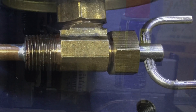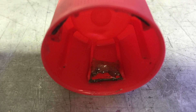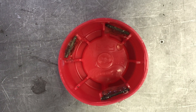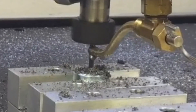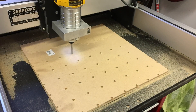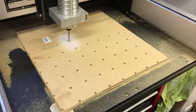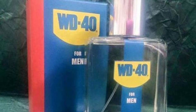Mount everything to the machine and look how pretty it is. I bent the handle in a U because it was getting in my way. You need to keep the can closed because chips will fly inside — I took the red top, glued in a couple of old magnets, and that works great. Drip rate: I use about three to four drops a minute on aluminum, a little bit more for steel. It provides lubrication and cooling for aluminum and is primarily for surface finish. The nice thing about this stuff is it doesn't expand the glue on MDF. And as always, remember — you gotta smell nice. My favorite cologne.